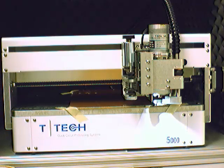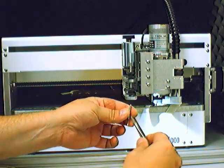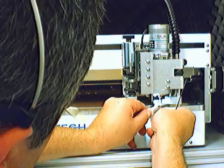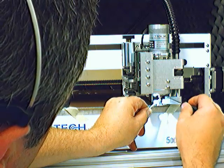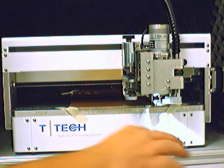Now we're going to select the 62.5 mil carbide router, since we don't have any drill bits that are larger than that. And this is the exact same process. Grab it with the tool grip, insert it all the way up into the collet as far as it will go. You can use your finger here, but just be careful not to poke it. The ends of these can be sharp. Hold that in place while we turn that clockwise to tighten the screw. And now the contour router is set in there just like a drill bit.